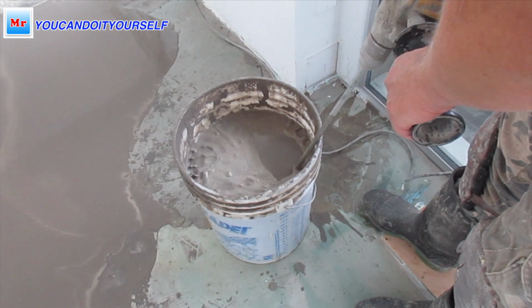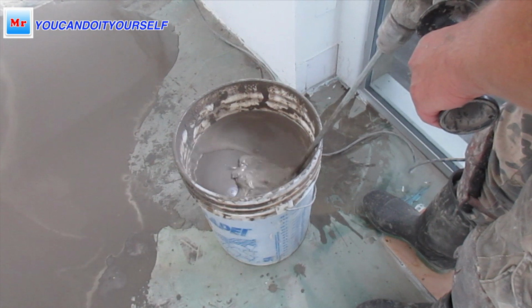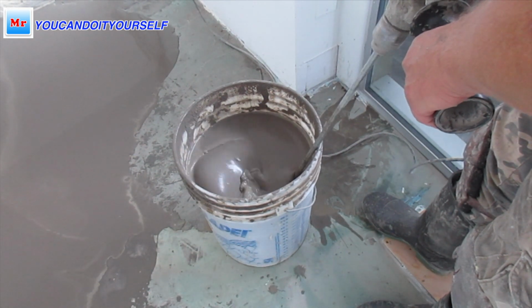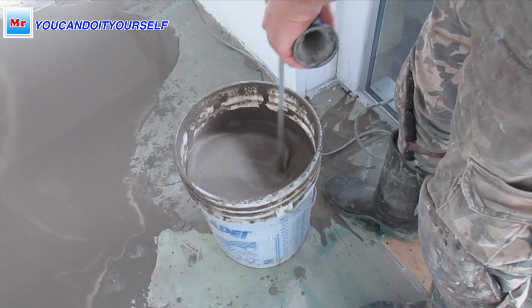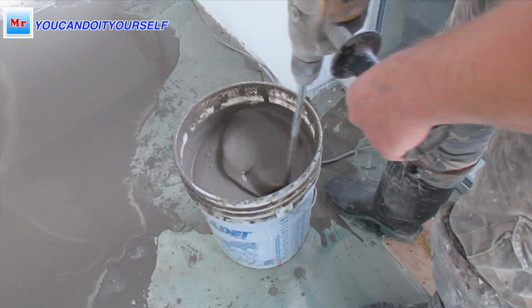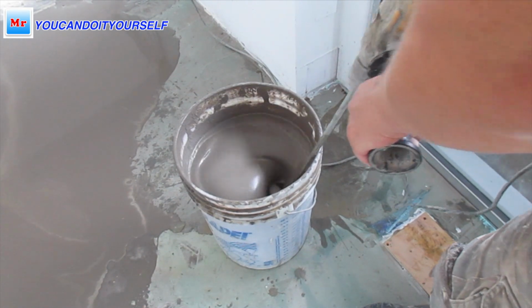I saw many times when guys apply self-leveling compound over the floor without using primer, all this concrete pops up. Just do it. I hope this video was helpful, and now you understand you have to use primer.